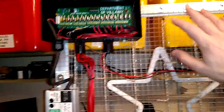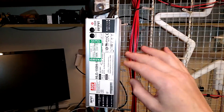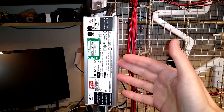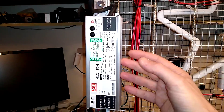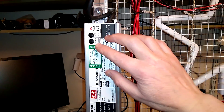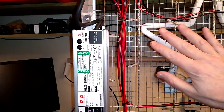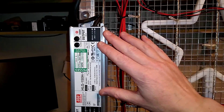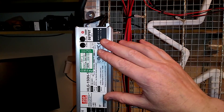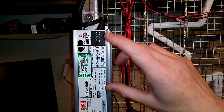I've turned the sign off and turned it round so we can take a look at the construction. Starting with the power supply — I've chosen a Meanwell power supply because it's got a good reputation for being well built, safe, and traceable. This is a waterproof supply with adjustable voltage. I've actually nudged it down 1.5 volts to take the strain off the LEDs so it underruns slightly, because it's an indoor display. It puts out up to 12 volts and can handle well over 10 amps — it's really about 150 watts.